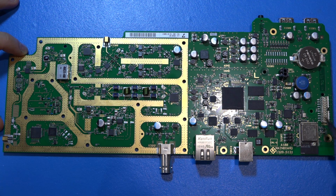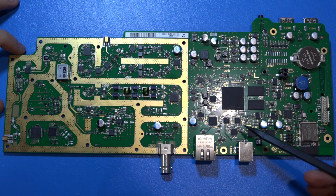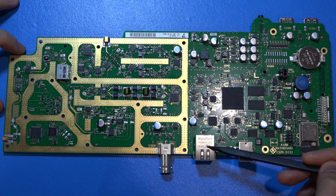Now, moving from the right side here, we clearly have our Wi-Fi module, and it is capable of having an external antenna, but you're using the internal antenna, so the RF field is confined to this region of the board, and you can see the RF input is all the way here. So the RF input and the Wi-Fi are as far apart as possible on this board, and that makes sense because you want to eliminate any coupling at all. There's an Atmel processor here, most likely to interface with the Wi-Fi module over there. Nothing surprising really. There is an interface here which is not being used, a battery, USB ports at the top if you've seen before, USB controller chipset, gigabit Ethernet controller chipset.